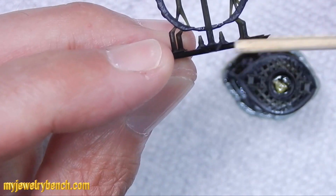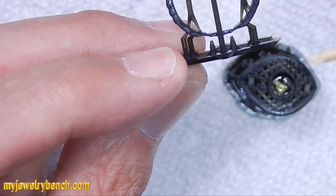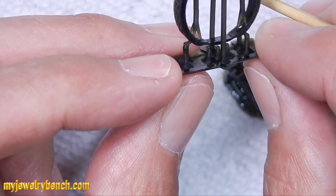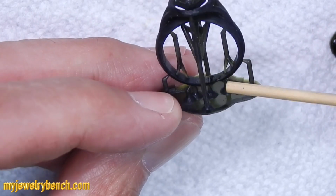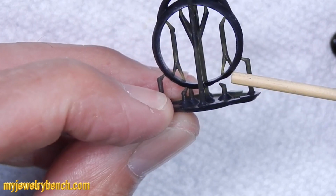So I'm thinking that obviously these settings are still wrong, but I'm getting a little bit better. The vertical printing helped tremendously. So if you're going to look to castable resin for your jewelry making, I'm going to suggest that you do it and print them vertically, because that way you're going to run into less hassles.